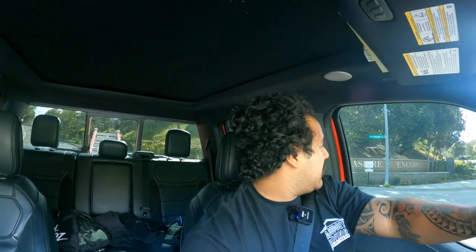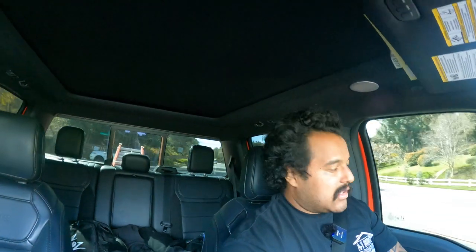Sometimes what happens in those situations is the tile pan has a 4-inch lip on one side that tucks up the wall under your Z-bar, and then a 6-inch run, which is what is on the roof, and then towards the roof where your tile sits, there is probably like a 1/4-inch lip as well. And what that 1/4-inch lip does is when the water lands on it and is flowing from the direction of the wall, it doesn't flow onto your roof.